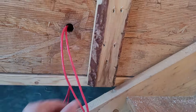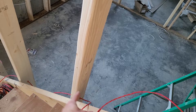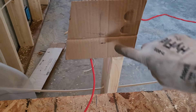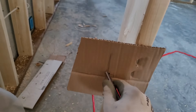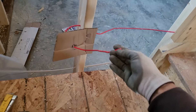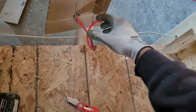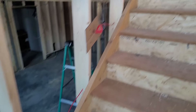The hole's drilled, so I'll poke the wire through here and into here. What I'm actually going to do is get some scrap cardboard and just staple it from this stud to this stud — or maybe just a piece like this — staple it, cut a little hole in it, and poke the wire through. I've marked where my light's going to go right here. I'll take a knife, make a hole in there, then take this wire and leave approximately 12 inches — one foot — sticking out, and just coil it up so it doesn't get pulled back into the wall.